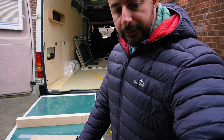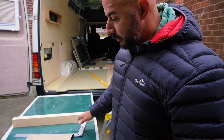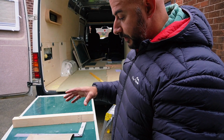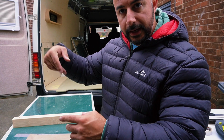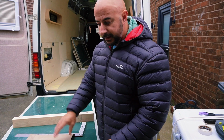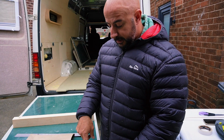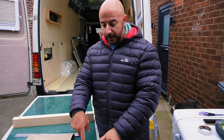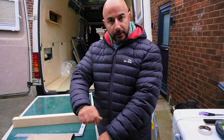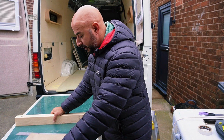Right, I'm going to cut the hole for the switchboard. I forgot to record, I added these battens to the outside wall of the shower where the switchboard's going to be. So this is going to be a double wall, and in between it is going to be all the cables running through. I added these battens so that the space was equal throughout. I just used some insert nuts into the green board and then bolted the battens through, tightened into the insert nuts, and they are solid now.